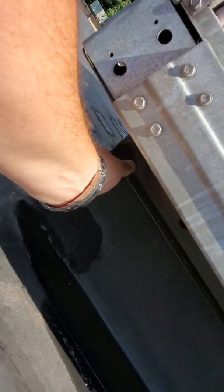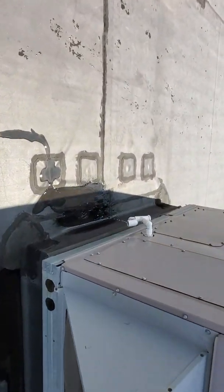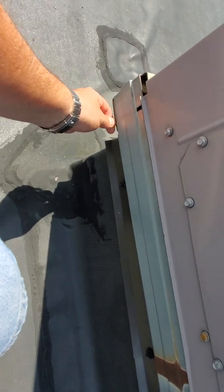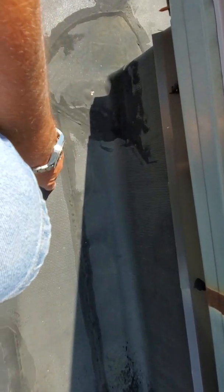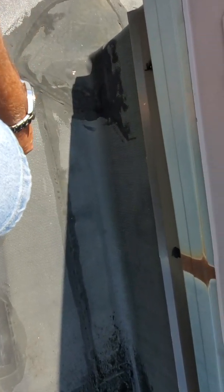You got flashing right there, and then there's a rubber roof going right up to the flashing and under the flashing. It's all the way around. You can see the flashing real good here — so all the way around this unit. There's a loose screw somewhere, so that belongs somewhere. But the flashing goes up, the roof membrane, which is right here, goes up and underneath the flashing. This is the flashing. I can't see how that's going to leak.